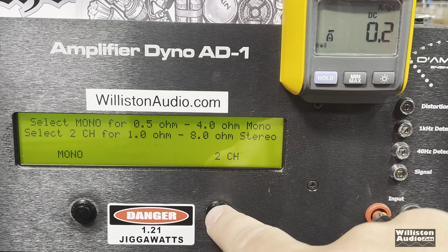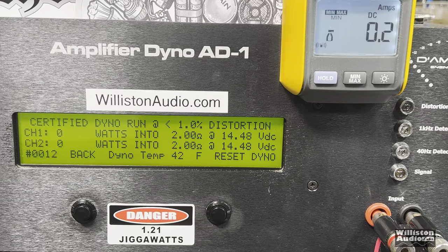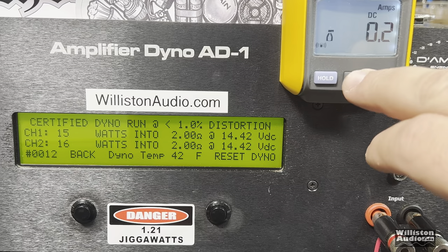Are you concerned about the dynamic test? Let's see — 1 kHz burst track, 4 ohms. We are dimming the lights for sure — 15 watts per channel. Now I'm not sure if the amp is going to blow a fuse or if it's even going to work in 2-ohm stereo mode, but let's try it. Two ohms, 1 kHz certified, 1% THD — hold on to your hats. Alright, 15 and 16 watts at 14.42 volts.